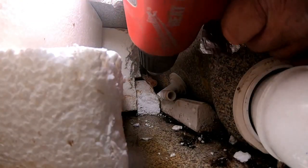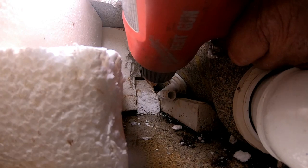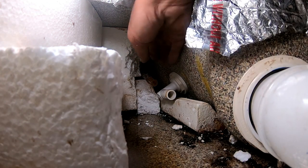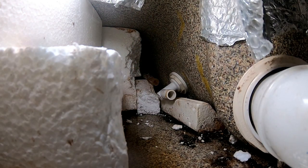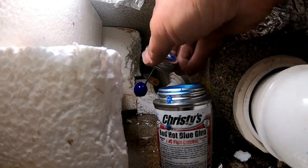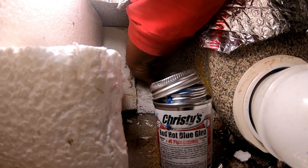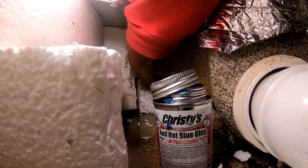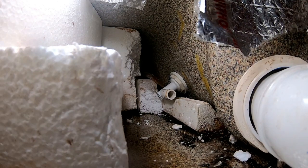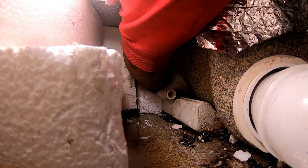I got the jet in place. Now I'm going to heat up the end of the hose — just shoot heat toward it, the heat will warm it up and make the tube pliable. Oh yeah, nice and squishy. Take a little bit of PVC glue, just dab it right on it. When I put the hose on I can twist it around left and right. Put the hose clamp on — it'll take a couple seconds to dry and it won't go anywhere.